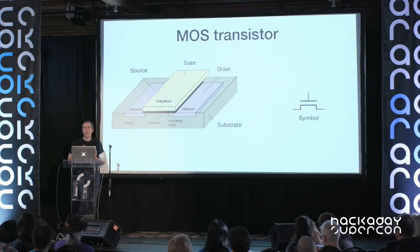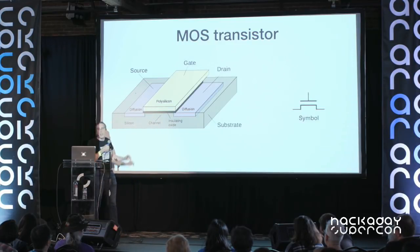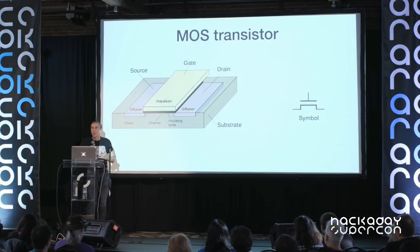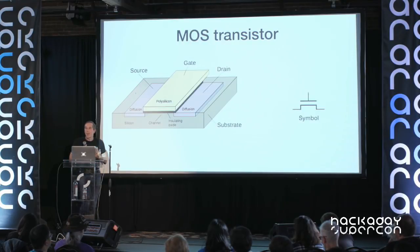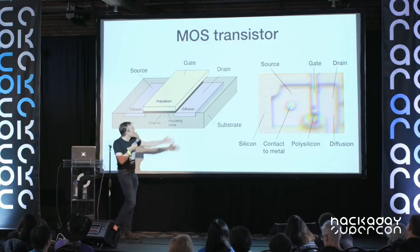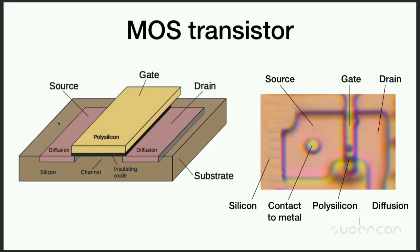This chip used NMOS technology, used by classic CPUs like the Z80, 6502, and 68000. For our purposes, an MOS transistor is basically a switch between the source and drain: conducting diffusion regions of silicon with an insulating channel in between. When you put voltage on the gate, the field allows current to flow — closing the switch. The gate is made of polysilicon, which forms another wiring layer between the silicon underneath and the metal on top. On the die, it's much simpler than an NPN: just source, drain, and the yellow polysilicon line for the gate.